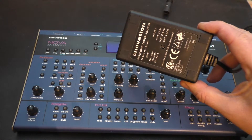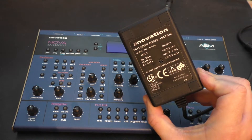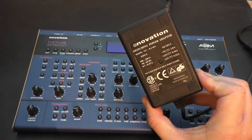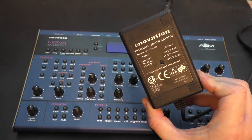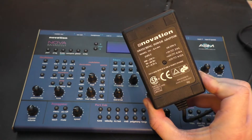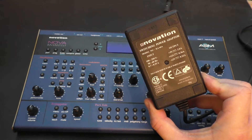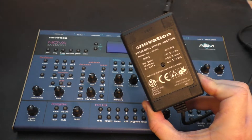The original power supply is the KA60A. It's a switching power supply with three voltages: +12V, -12V, and 5V. I will show you the pin out of the connector later in the video, so you could even replace it with a standard ATX power supply from your computer, but I would say this is not a very elegant solution.